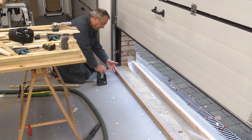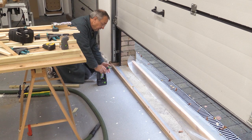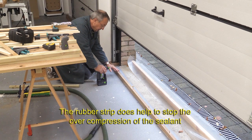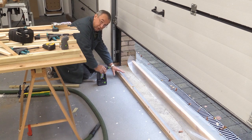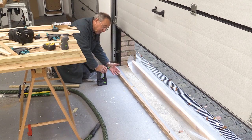When you're using a filler as a sealant, it's very important that you don't over-tighten screws to squeeze out all the sealant from underneath. The reason is simple: this sealant is flexible and has gap-filling capabilities — it can expand and contract as the piece of wood might move a bit. But if you over-tighten, that's going to squeeze out most of that filler, leaving a very, very thin layer. With such a thin layer of sealant, just the smallest amount of movement can cause a leak to go across that sealing barrier.